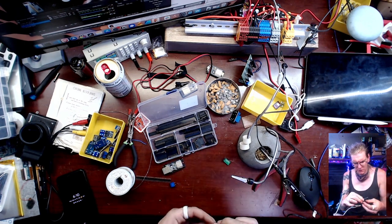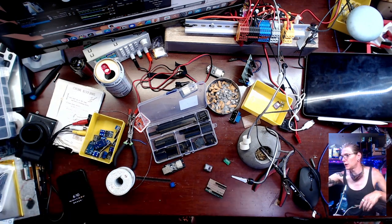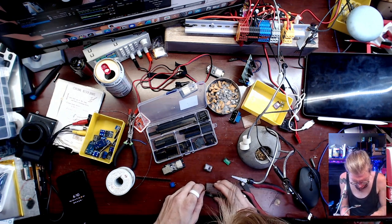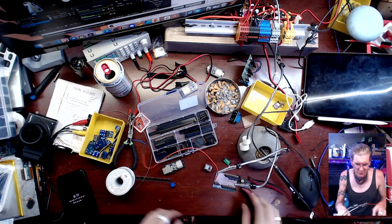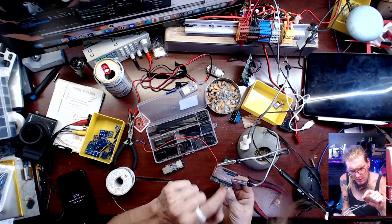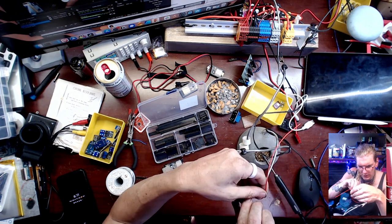a wire from over here to over there. Red wire. Bunch of red wire. What do I want to do with it? Should I do this and then kind of wrap it around there? Yeah, that's not a terrible idea. I'm into that. Pinch down. There we go, sir. And then my VMOT pin is this one right here. It's my voltage input for the motor controller.